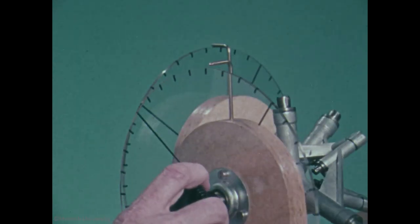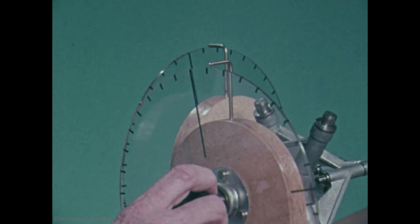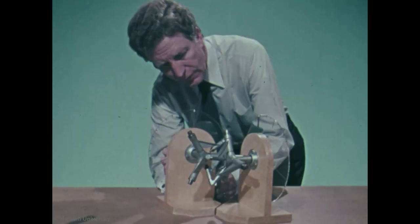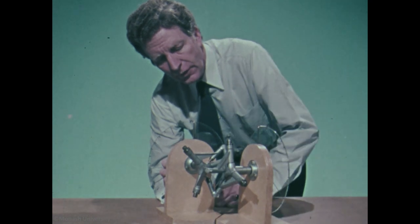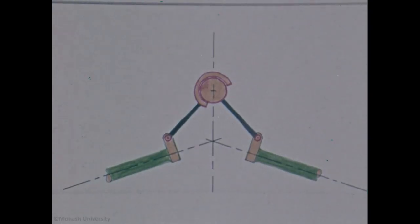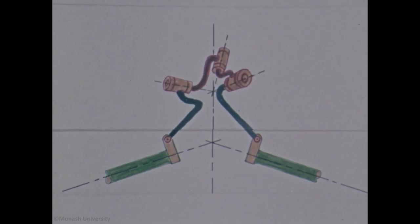As I turn, you can judge from the dials that the transmission is uniform. But this is rather a special non-plunging coupling. If we look at the single connecting chain again, we can, without any restriction of freedoms, imagine the three rotary freedoms of the ball cup joint to be provided by three non-coplanar intersecting hinges. However, a plane of symmetry can still remain even when these three hinges do not intersect at a single point.